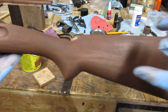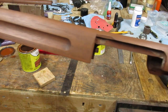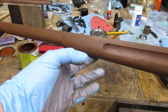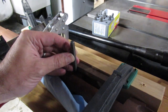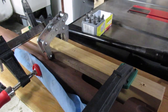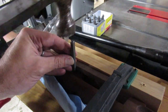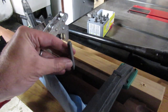This is the finished result. I think that's good as a medium brown, and that's pretty accurate to all the pictures I've seen of them online. I think the color will lighten up just a little bit with the boiled linseed oil, and that grain will just pop a little bit more. One thing I noticed on the reference pictures is that the serial number is stamped on the side of the stock on the left, just in front of the side plate — it ends up being under the serial stamped on the receiver. I'm using individual number punches with a guide and spacing marks. I did a few practice runs on scrap, but even with all that help it's still hard to get them perfect. Overall, I think it came out okay — it adds a nice touch to have a match to the rifle.